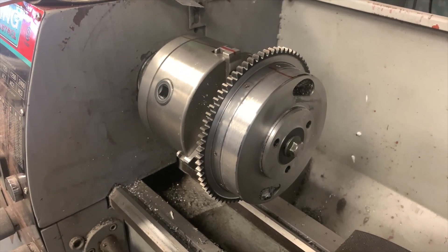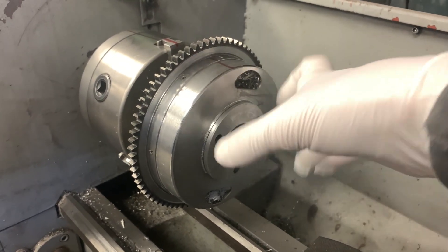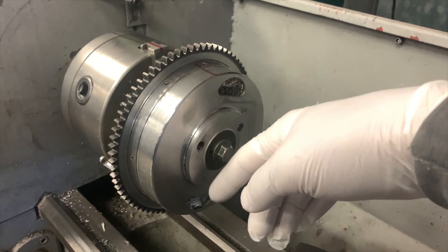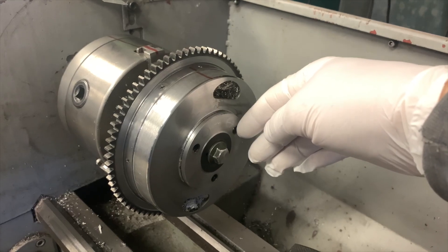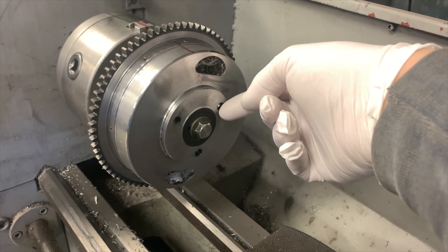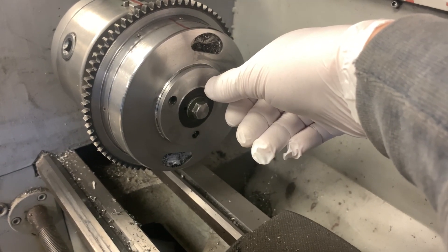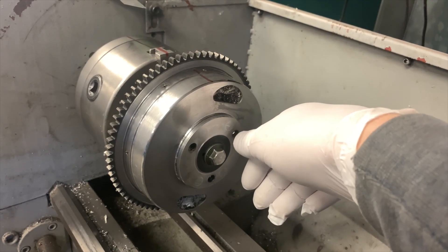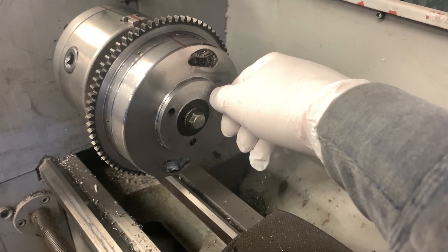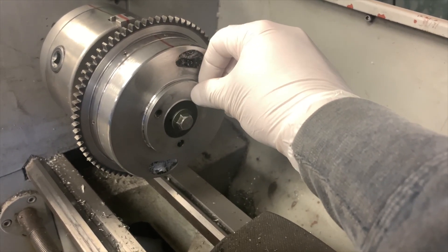It's the next day and I still haven't completely figured this out. I want to make sure that this stays indexed — that it doesn't move at all. So I'm only going to take three pins out at a time. Before I do anything, I'm going to take either quarter inch or six millimeter bolts and bolt this together as tight as I can through the puller holes. Once I have it bolted together nice and tight, I will knock out three of the pins. My plan is to knock them out, shorten them, knock them back in, and then weld each side. The main objective is to make sure the pin is recessed far enough in the hole so that even when I machine the surface flat, I have a nice bead of weld holding it in.